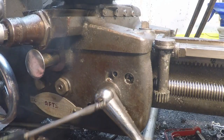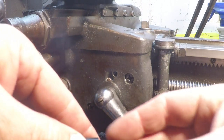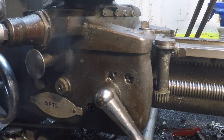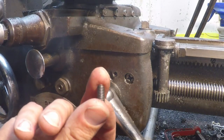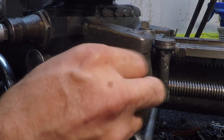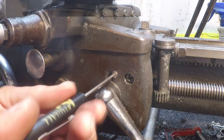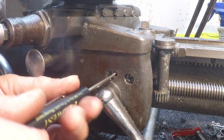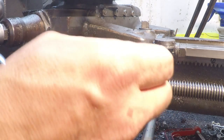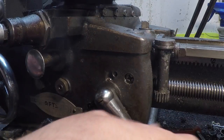Let me grab a scale and measure it — it's just about five-sixteenths of an inch. Three-eighths would be fine and there's plenty more room in the bore. The ball is still inside, so I'm going to stick this back in before I lose it. You can see how long the set screw is — there's no reason you couldn't use an Allen set screw; it's just fortunate we have the original. How tight you make this has a lot to do with how the detent works — right now it's flopping with no lock-up, but a touch tighter and you don't want it falling out.